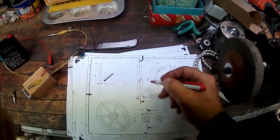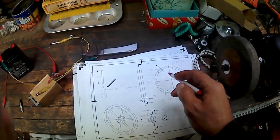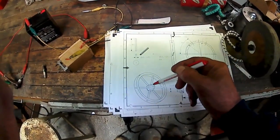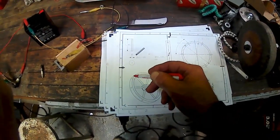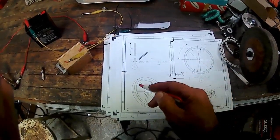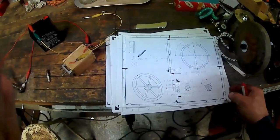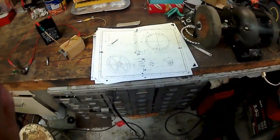But like I say, I'm going to take some square stock, bore the hole in the 4-jaw, then clamp it in the 3-jaw, turn the outside, and I'll leave the outside just slightly heavy so that when I put the spokes in, lock it in place, I can put it in 5/8 collet and finish turn the OD. I'll probably leave it a little thick also. I'll finish turn the OD and the sides and everything back to the hole or the hub. So anyway, it looks like I got to go and get a number before I can round up some stock.